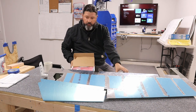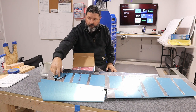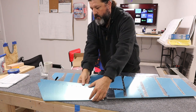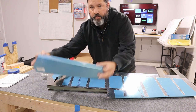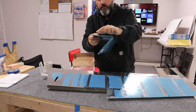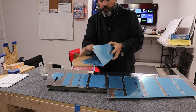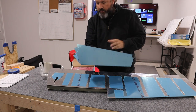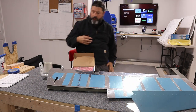This little box contains all the parts for the servo motor that will be mounted to this plate and installed in here. From there, the trim servo motor will drive the trim tab, which needs to be bent, edge finished, and folded. These ones will be a little bit easier to fold because there's more room to work on it. The spar needs to be shaped and completed to put everything together.